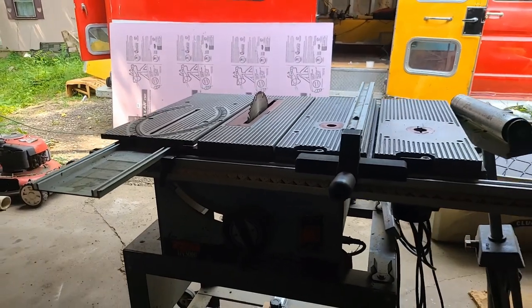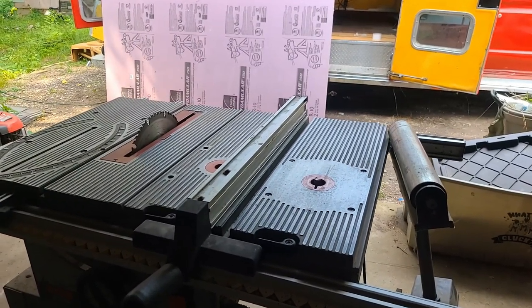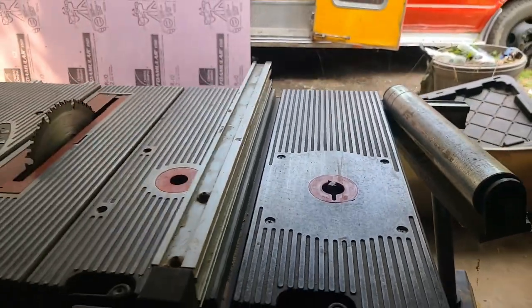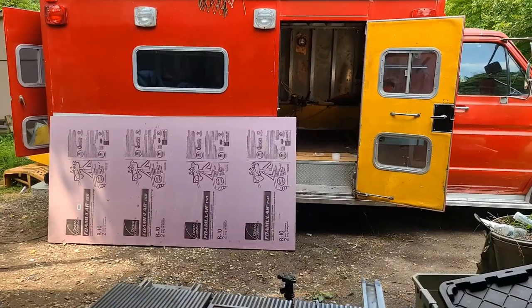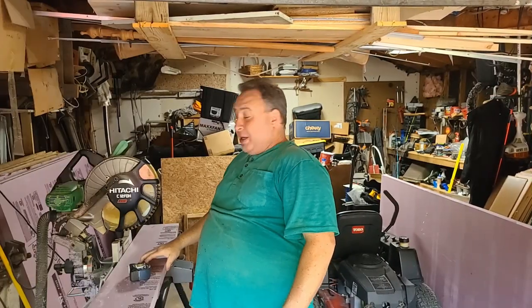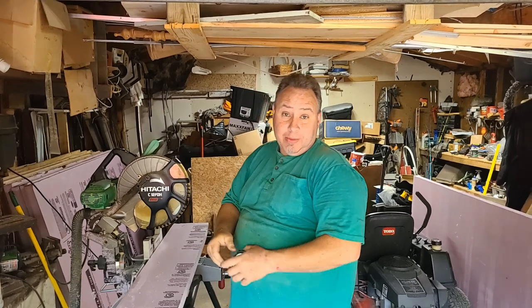As you can see here, we have my old faithful Ryobi table saw that also has a router attachment. I'm slotting out channels for the wiring — make my cut here, slip that piece over, and as you can see I've got about a half-inch cutout bit there that I'm using to route for wires. The next step is to take the miter saw, cut these into 17-inch pieces for the roof so I can slide them through, then run them through the router.